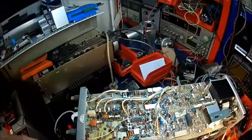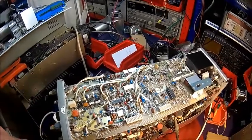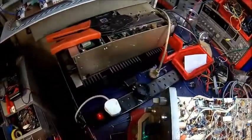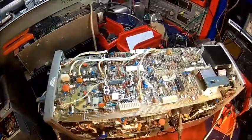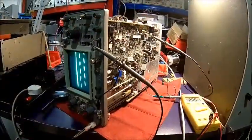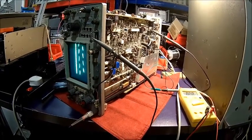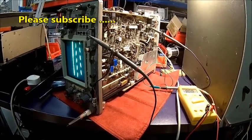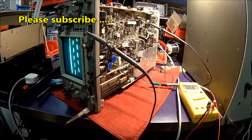Good. Let's solder the trigger resistors - we've got all the screws in already. Let's solder the trigger resistors and have a look at the other side; maybe there's a screw missing or some voltages are noisy. The A amplifier is still out. We may have another voltage with a bit too much ripple. That's it from today - we'll cover the rest in a separate video. It's too much for a single video anyway.